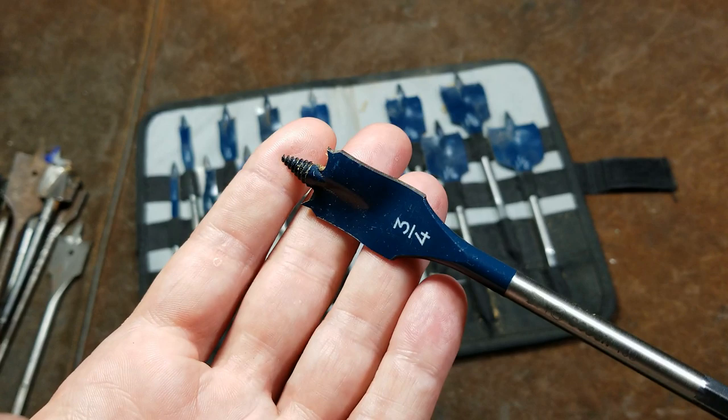There's a little S-shape on the bit which forms a curve so that material can more easily come up and get cleared out from the cut face. They also put a coating on it, which does tend to wear off — there are a few here where it's already worn off on me.